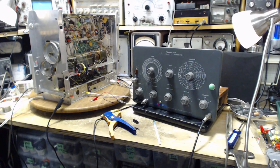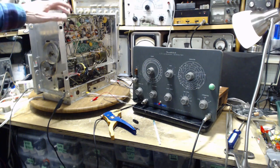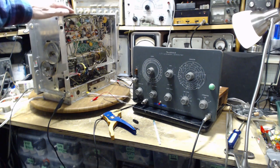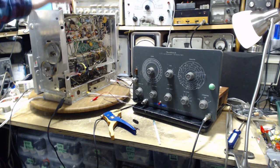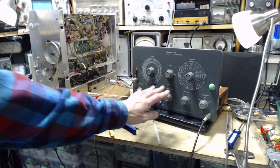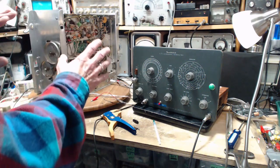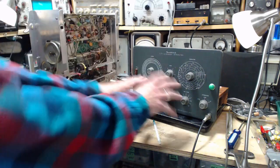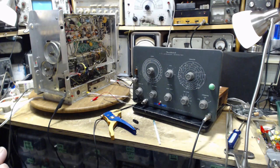Each time through, we learn a little more, make fewer mistakes, get more familiar with it. At this point I'm pretty sure I know what's going on in this radio in terms of the IF, because I aligned it. I know it has a sharp IF, probably too sharp, probably not passing enough signal on to the subsequent circuits. That's why when I tried to align subsequent circuits, I had trouble. With me knowing what is going on with the receiver, I can now work with the signal generator and interpret the results properly. It turns out my oscilloscope lead was one of the bad actors. The other bad actor, of course, is me — I'm somewhere on the learning curve.